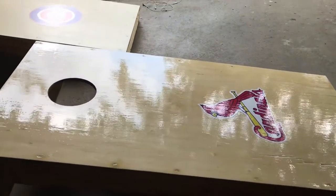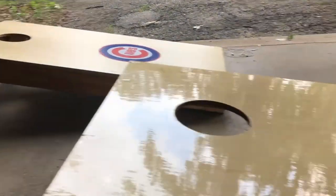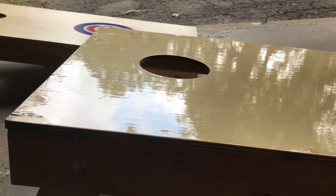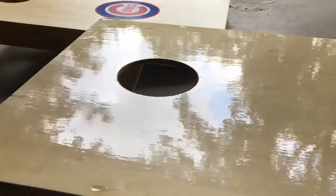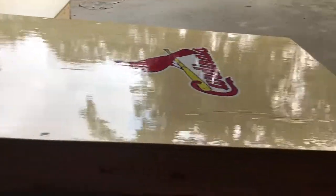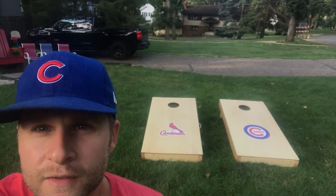I just wanted to show you something in between coats. You can see one board hasn't had the next coat of polyurethane yet, and one has — look how shiny it is. The best way to see if you missed a spot is to get an angle with the sunlight coming at it. You can see all the shine and find any dull spots where you missed. There's a little spot right there that's not as shiny — I missed that spot. Go back and grab that spot, get it covered. Now she's fully covered — you can see it shining. Let it dry a couple hours, get another coat, and we'll see where we're at.